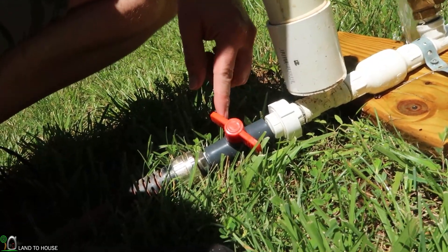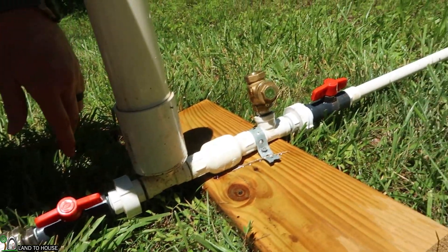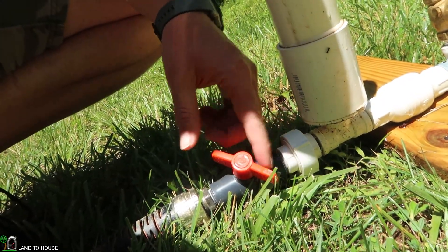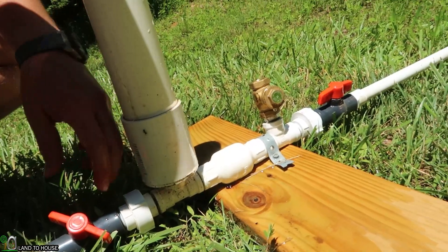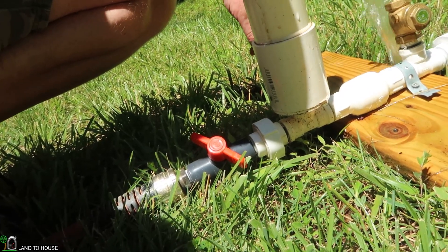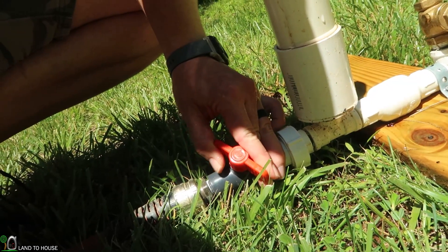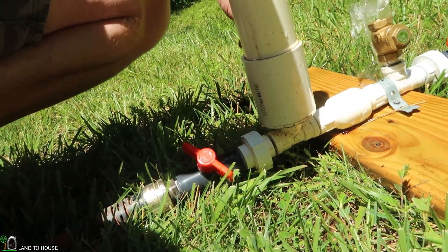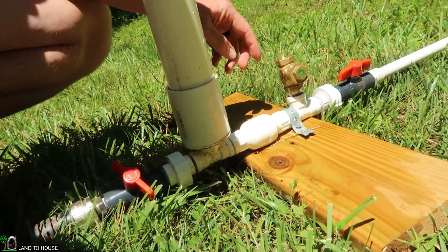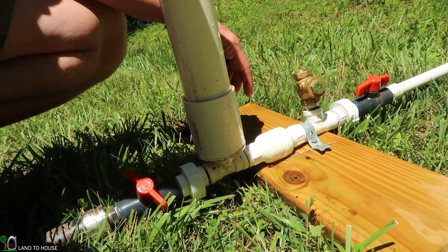My delivery pipe is just cracked open. As soon as I open this all the way the pump's going to stop, because this is introducing a little bit of back pressure back on the pump. We have to fine-tune this to find the right spot — open just slightly — and that should keep the artificial back pressure there. It's touchy.